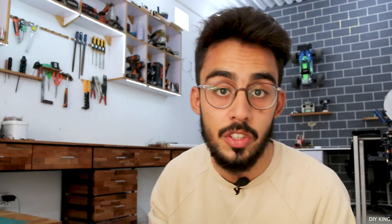The boards are almost complete and we have swapped the fan with a more powerful one so that we can blow a lot more air on the MOSFETs to keep them cool. Now in order to complete this whole circuit we are going to need the induction coil, which is going to be built out of thick 12 gauge enamel copper wire. So let's straighten this wire up and wind the coil.